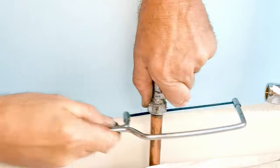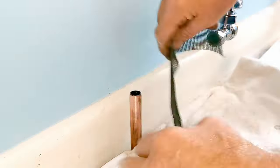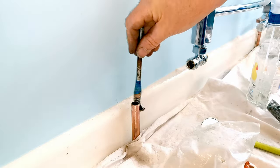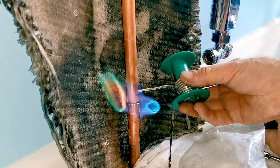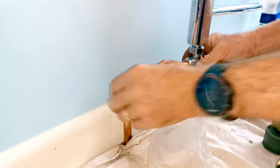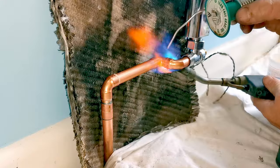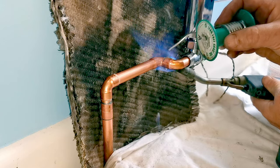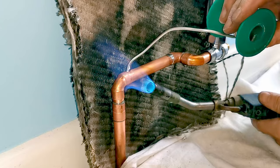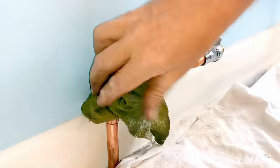After finishing the soldering I check all my joints, wait for it to cool, and clean off any dirty marks on the wall and pipework. The right-hand pipework is all finished. On the left-hand pipework I used a junior hacksaw to cut the valve off, but found the pipe was a bit crushed so I had to slice that off anyway. I clean it, check around the back with my mirror, remove any water, flux it up, put the fitting on and solder it up. I then mark the height, slice the pipe, clean it and repeat the same process as the other side, flux it all up and solder. Always point your blowtorch away from the heat mat and anything else likely to be damaged by heat. And that's both bits of pipework complete.